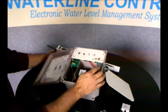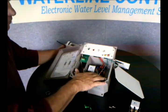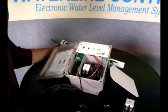It has a press-to-test switch on it, so if you ever have an issue five years from now — when this relay or that one fails — you can press the test button, the light will come on, and the corresponding relay should come on with it. If the relay doesn't come on but the light does, then you know the relay needs to be changed.